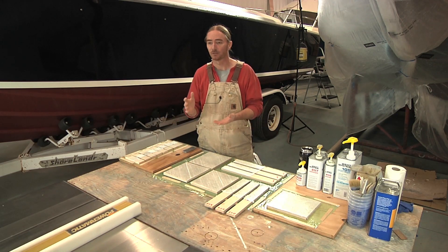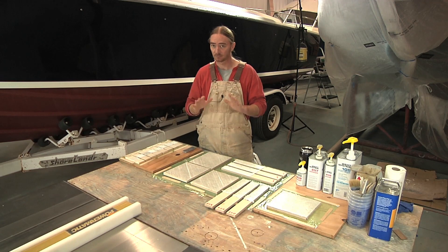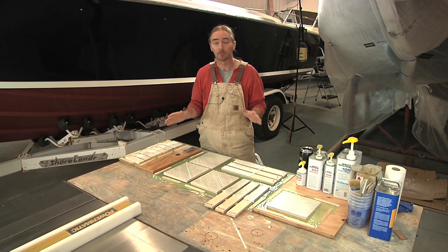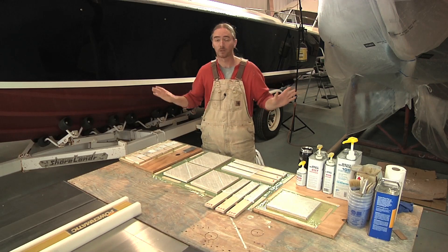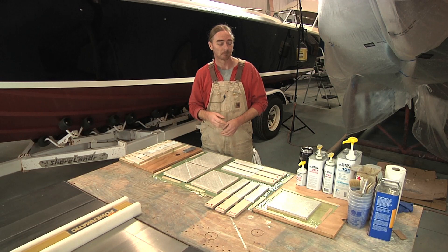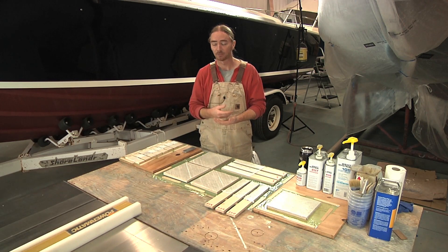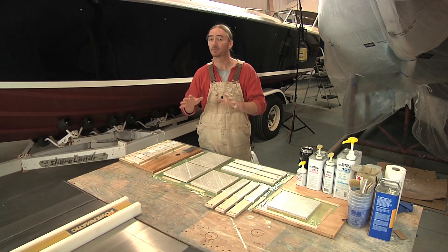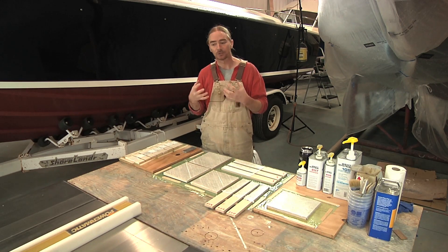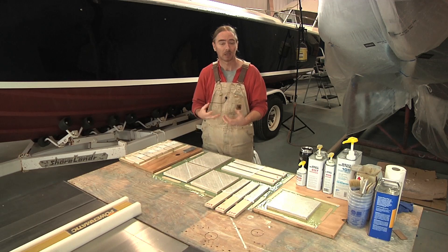There is no more laminating. Your hull, all that glass, your gel coat — that's already cured. It's no longer a laminating-type surface. That window is closed. What you have to rely on is having the surface cleaned and prepped and scuffed enough, sanded down, creating that tooth for all your material to bond with.